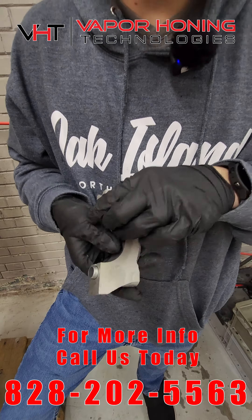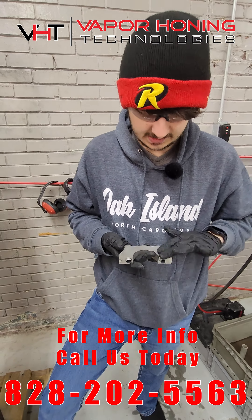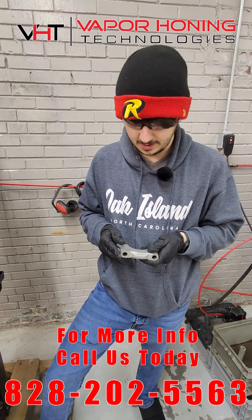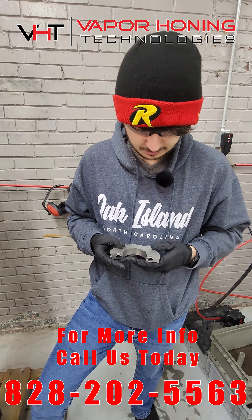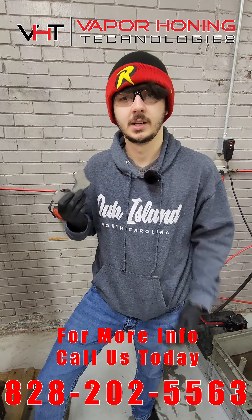As you can see, the parts polish back up and the flash rusting has been ceased — I don't see anything forming already. Usually if you don't have corrosion inhibitor you can start seeing a little bit of flash rusting occurring, but I think we've got plenty of time to put some kind of coating on this and get it back to work.